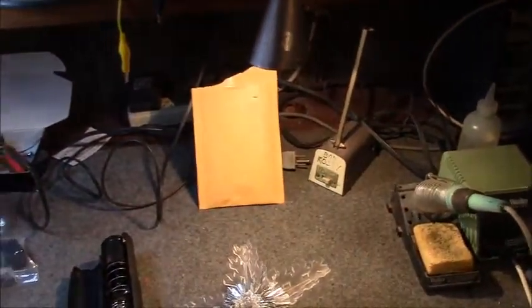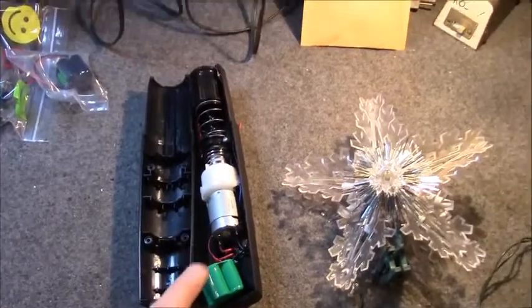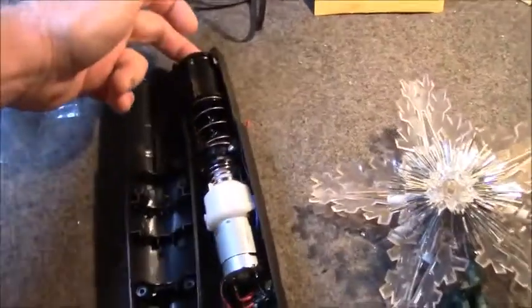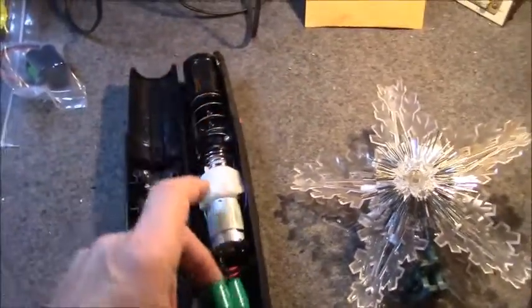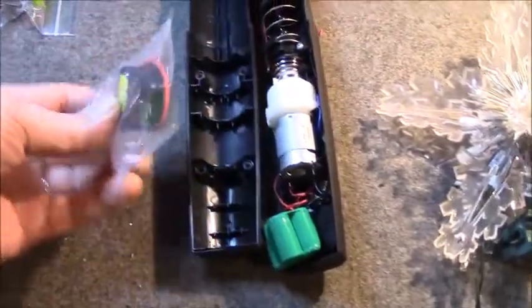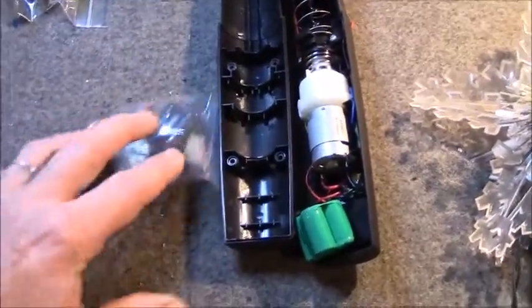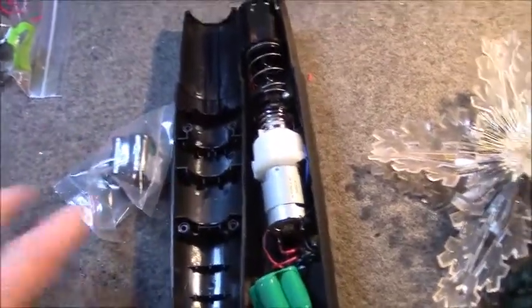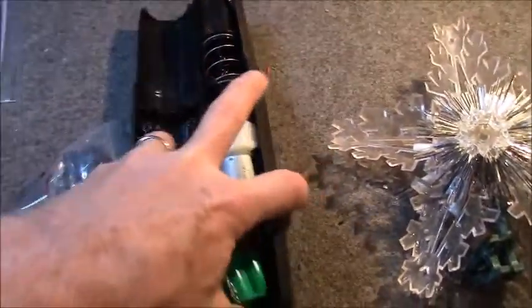The first project we need to do is my wife's battery-powered electric wine bottle opener. It has a corkscrew in the end, electric motor, rechargeable battery. The battery just doesn't have any power left. I ordered a new battery pack — nickel metal hydride, 150 milliamp, 4.8 volts. We'll be re-soldering that in and testing it.